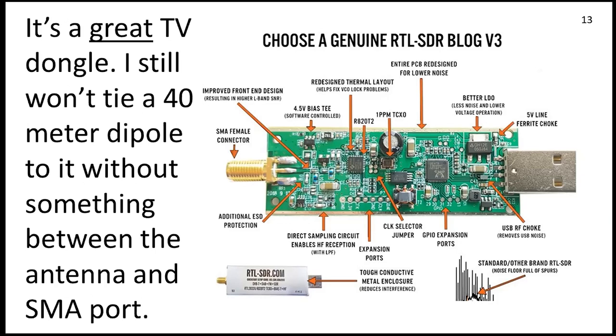That's another reason to have some external circuit with back-to-back diodes. Just pick some tiny back-to-back diodes — it's a clamping circuit. Two diodes back-to-back going to ground won't let any voltage greater than 0.7 volts either way. Or you can go get a 6AL5 tube and do the same thing. You could mount that 6AL5 inside your transverter box and you'd stabilize the oscillator further by keeping it warm.